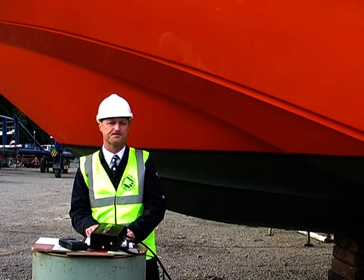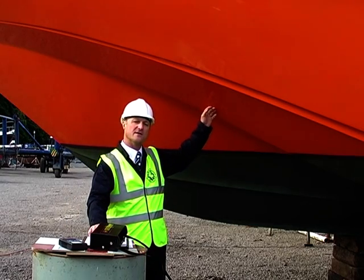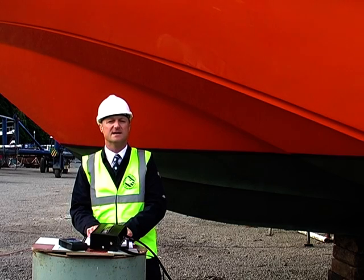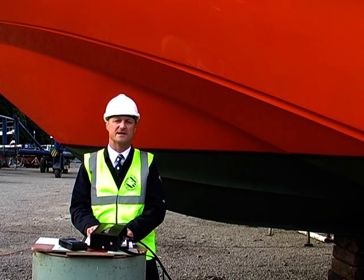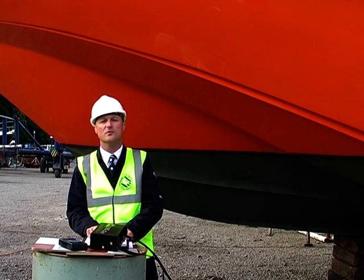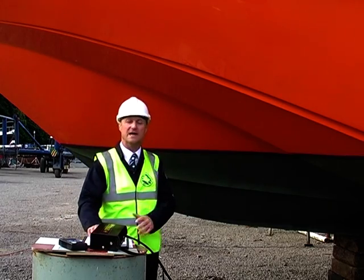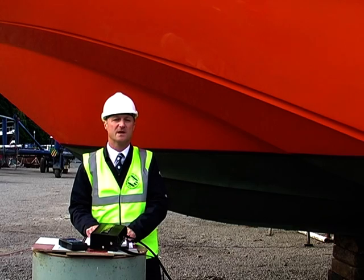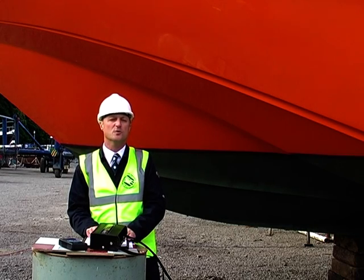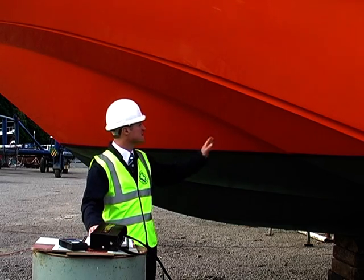But this process may take a few weeks. Most problems seem to arise when water collects between the gel coat and the first small layer of the chop strand mat. If there are voids present in the original layup process, this occurs more rapidly as the molecules have a site within which to aggregate. In the presence of unreacted binding agents, glycol, or undercured resin, the water may even form new larger molecules that then attract more water into the void. And this is the process that should really be technically called osmosis. It's this final process that may then lead to blisters underneath the gel coat which will become visible. In worst cases, the water or new chemical compounds may even hydrolyse the matrix and cause damage to the laminate itself.